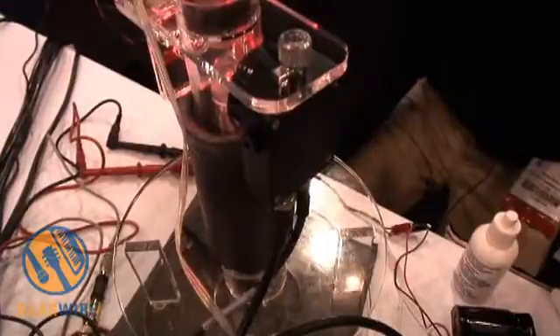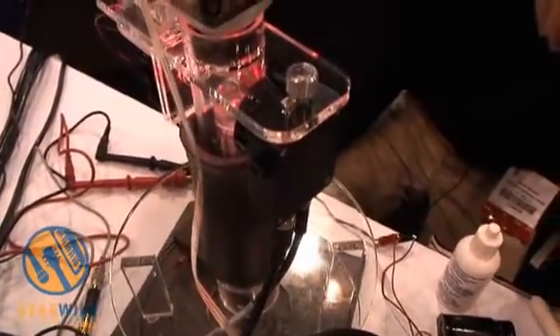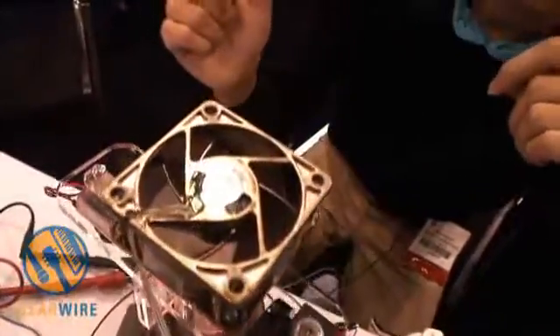Currently we're using an acrylic plastic housing, which is a high-Q material that resonates a lot, so any sound that goes in here after passing through the smoke is reflected back off the plastic housing and we get a kind of tinny, reflected plastic sound. Ideally it would be made of something like foam or vinyl — something soft but still rigid that would absorb more sound.